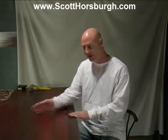For me, I think one of the keys of accurate carcass work is in the marking out of all of the various components. Wherever you have components that need to be a similar length or dimension, put them together on your bench, clamp them if necessary, and mark them out as one. And that way, when you scribe a knife line, either off a marking knife or a marking gauge, you're guaranteed that they are all exactly the same.